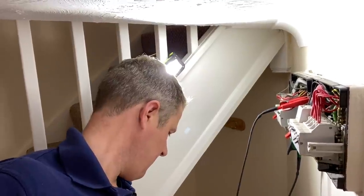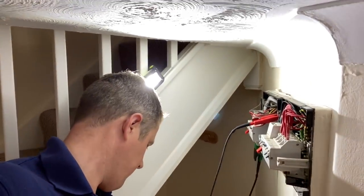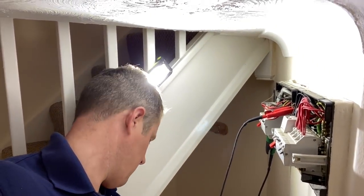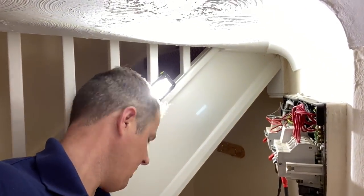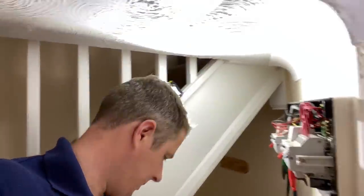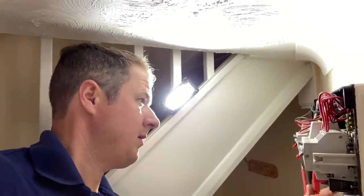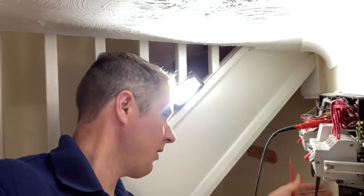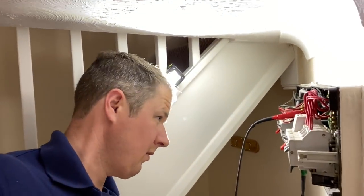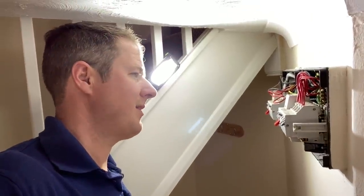Cables, all clear, phase to CPC, all clear, neutral to CPC, and all clear, phase to neutral. Just do it again at 500 volts just to double check everything. All good, fine. So now because there's no RCDs to test, we skip that stage and we go straight to the live testing.